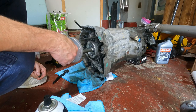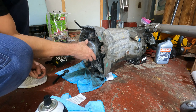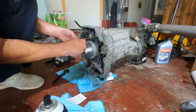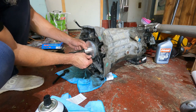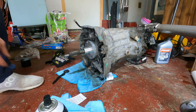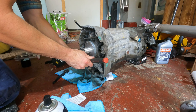Now into the next part. For this tilting unit, you got this plate with the threads. You're going to stick it on and get it to sit in the cup here. There we go. And then try and get the bolt holes to jive. I'm just going to get these started - I'm not torquing them down yet. I'm just getting them started and on. And then when I like what I got, I'll torque it down and finish it up. Just going to snug it down. Snug. And snug. There we go. That looks very good.